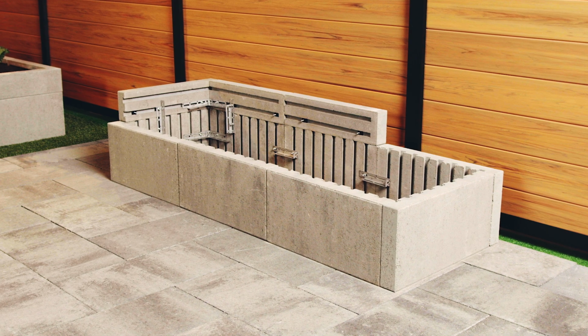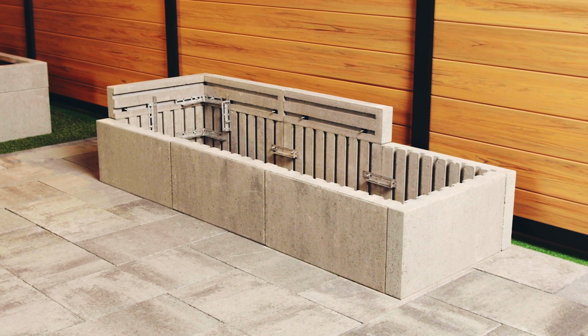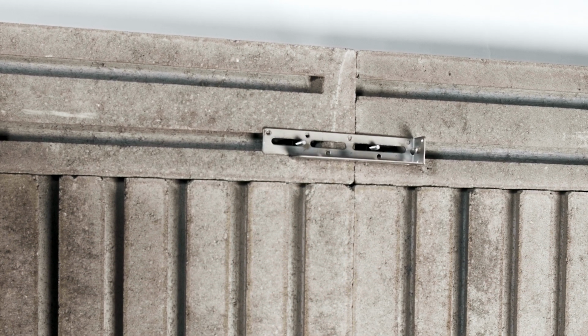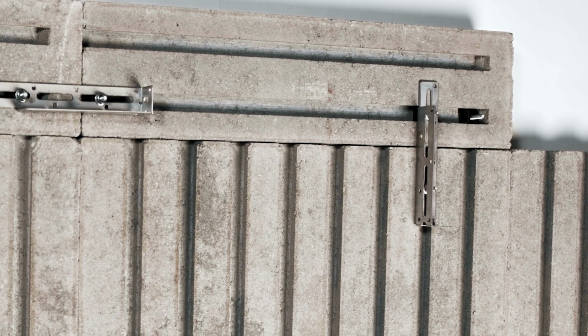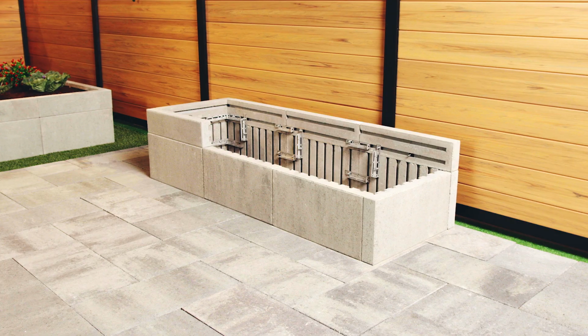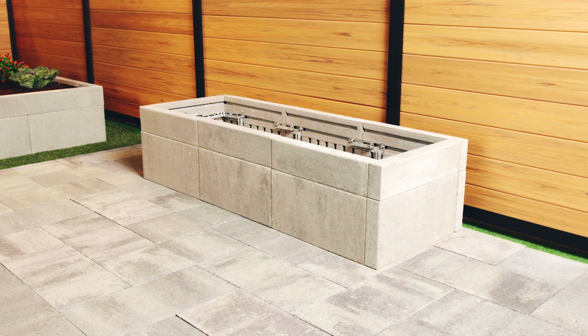Next, place a small block next to your previous panel and make a horizontal connection. To make a horizontal connection between 2 small panels, attach your bracket to the nearest slider bolts in the lower channel of your small DESIGNFORM. Note: you will also need to make a vertical connection with each horizontal connection. Continue to work your way around, offsetting your blocks. Pretty easy, right?